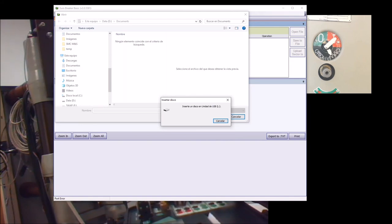The reason why I'm asking is because we had some discussions inside the company, and from what we were able to check in the standards, it would say a minimum of 50 amps according to the IEC and 100 amps according to the ANSI standard. Now, obviously, the unit is not going to inject that. The only problem is you would be thinking, how accurate would the measurement be if you're not actually injecting a higher current? Because you need a higher current for a higher accuracy, and I would say you agree with me on this.